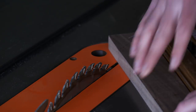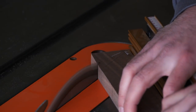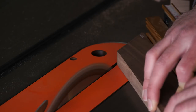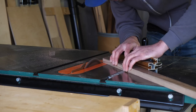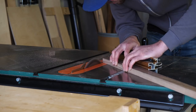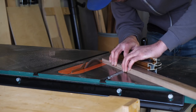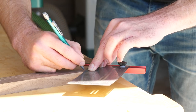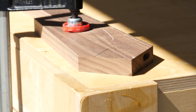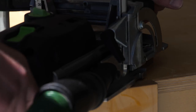The last thing to do before I could join the legs was to cut miters at the intersection. Earlier I said this would come together to form a 90, so you'd think it would just be two 45-degree angles — but it's not, and that's because of the tapers we cut. You could cut at 45 and get a right angle overall, but the pieces would end up looking like this instead of like this. So it actually comes out to some weird angle like 44.2 for one of them and 45.8 for the other — it just depends on how you cut your tapers. Once those were cut, I mortised in some dominoes and then glued them up.